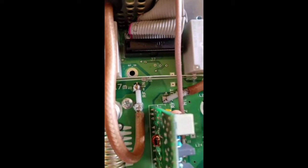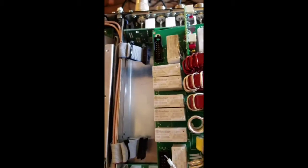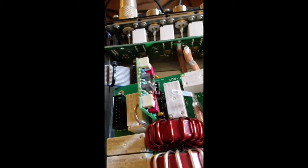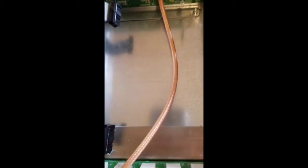The first thing we see is that the RF out is part of the RF deck. It has a cable that goes directly over to the switch-selectable antenna card. That cable needs to be unsoldered and removed. It has a simple soldering arrangement — just the shield, braided shield. It's already soldered in, of course, and there's the braided shield over here. With the new board, the orientation has to be so that the connectors are dimensionally lined up. The board comes with an already nicely made-up cable for the RF in, and then the RF out goes directly to the relay board. So we'll move forward with that procedure and take out the existing cable.